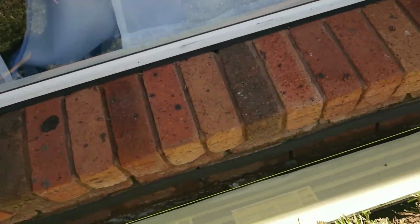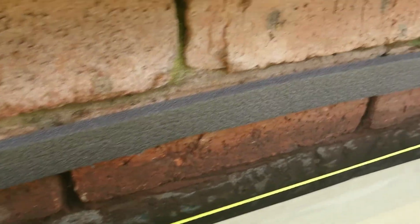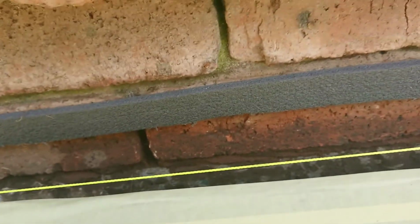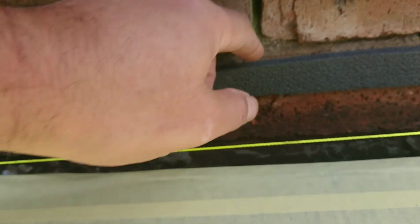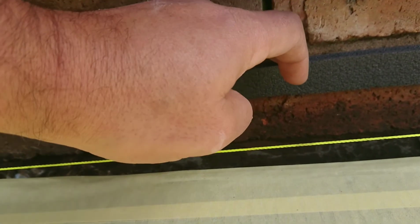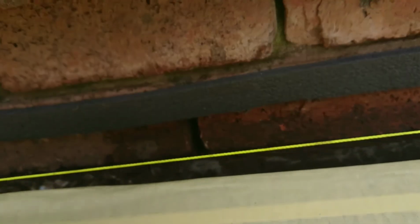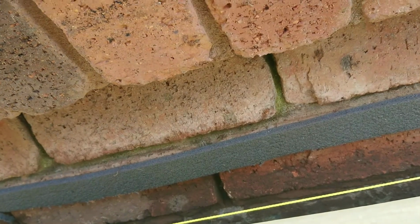Meanwhile, this is just me thinking, I already put it here, as you can see on the wall. Maybe a lot of people will ask, what is that for? I'll tell you, every concrete shrinks. So if it shrinks, it leaves a gap behind that compressible material, and water could easily flow behind. The rainwater, for instance, flows behind that into the ground, into the soil, and basically it goes into the foundations.